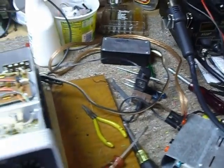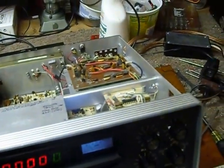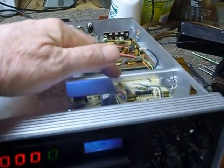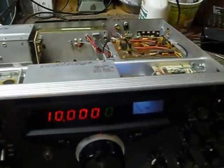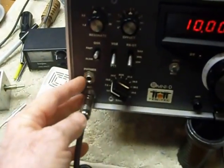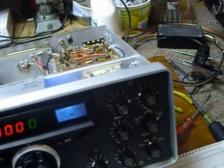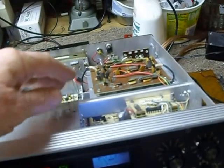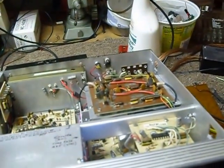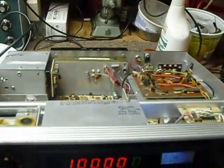So I think that's a really good solution. Just put a connector on the back. I did have to take the front panel off — had to take off this bar right here, take this circuit board loose, take out the display unit, take all the knobs off the front, take off the phone jack and the mic jack, remove the big main knob, remove the zero beat. But that stuff doesn't take much time really — in less than an hour and a half I had the whole thing done. I drilled the hole in the back, ran a wire over, then took the wire off the PTO and ran it from the back directly onto the PTO. And it just works great.